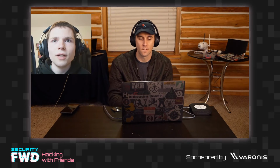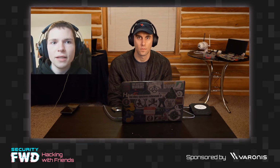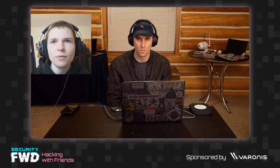Yeah, so we are going to try to catch a four-way handshake. And for that, we need the ESP32, because you could still capture a handshake with the 8266, but it will be cut off, so you cannot try to crack the password with that. That's what you usually do if you capture a handshake: you would try to crack the Wi-Fi password. You could still receive it on the old chip, but you wouldn't be able to do much with it. So that's why we are using the ESP32. And let's just try out if we can get this working.